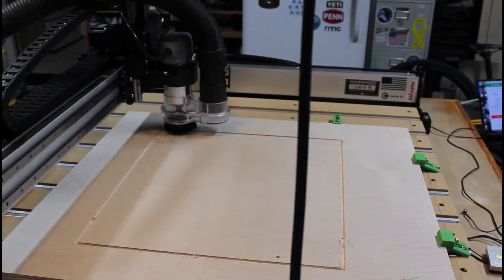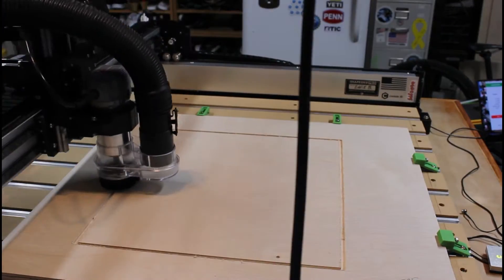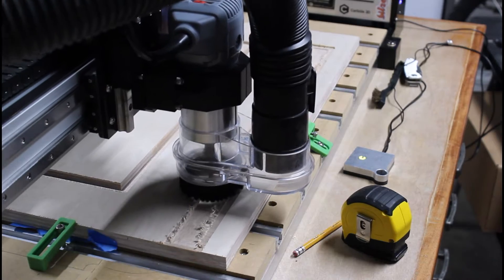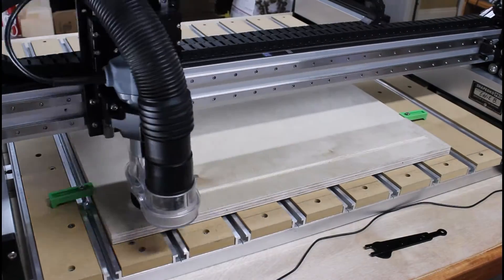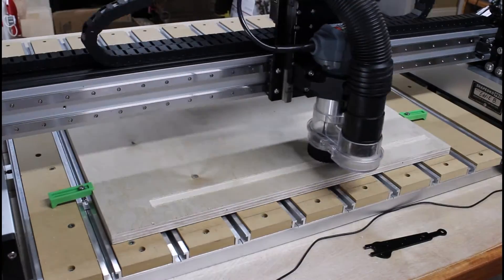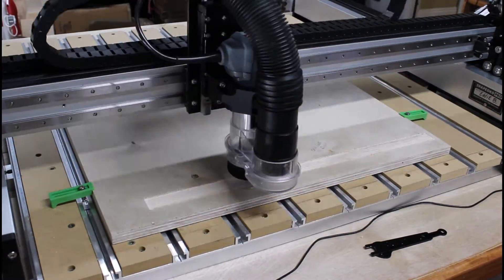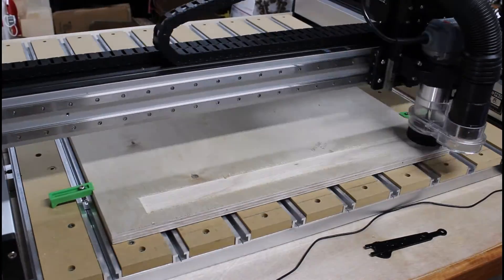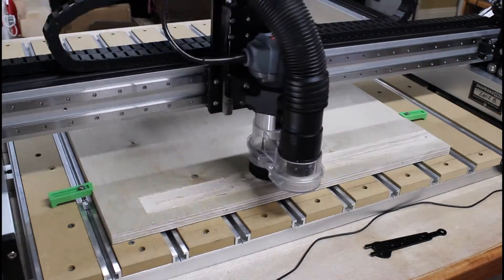As you can see, the machine is cutting out the windows and adding the rabbet, which will allow a place to insert the polycarbonate panel. At the time of this build, having zero experience using Carbide 3D's Carbide Create software, I made an attempt to design and use my Shapeoko to manufacture each of the panels. The software is very intuitive and making the panels was a lot easier than I thought.